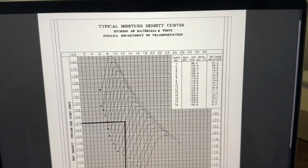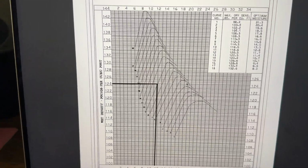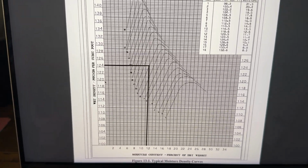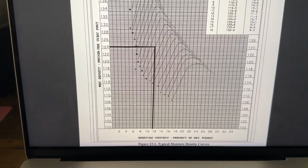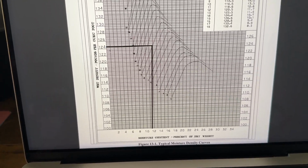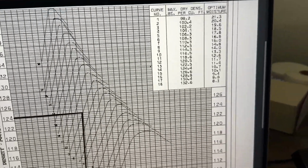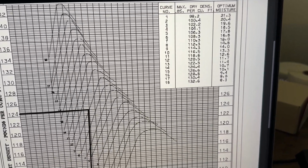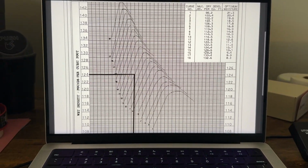Okay, so here we have the Indiana Department of Transportation's family of curves, which we use to plot the values that we got in the field in order to get our max dry density. Like I said earlier, we had 124.85 pounds per cubic foot for our wet density. And I popped a nuke gauge test in earlier, and I got 11.6% moisture in situ for the soil. So I plotted the 11.6% moisture right here, the 124.85 pounds per cubic foot right here, and they met at this curve number 9. Then I went to this table in the top right and looked at curve number 9. We have a maximum dry density of 114.3 and an optimum moisture of 14.0, which we will use to test against when the contractor is backfilling. Thank you for watching.